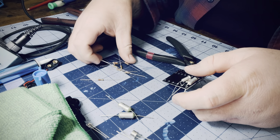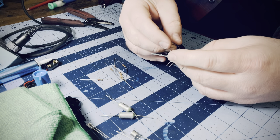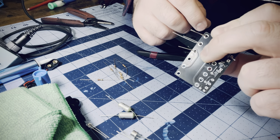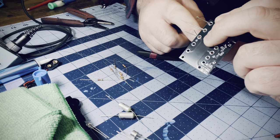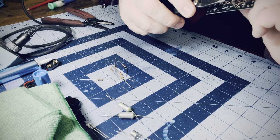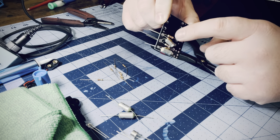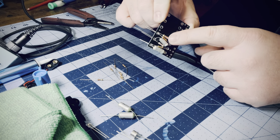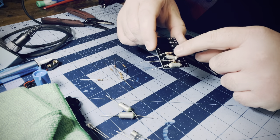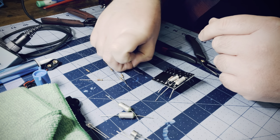Next I'll need a 2.2K. This also comes off of the same point — that's where our link is — coming off of power, your negative 9 volts, and that hits the collector of Q2. You can adjust this as well. On Descry, I made this a pot instead of the 2.2K resistor — it's a really fun mod. It gives you a big range of textures and you can do gating and open tuning and stuff like that.